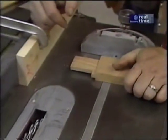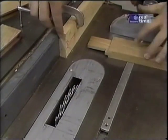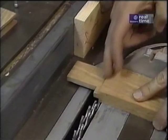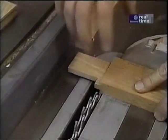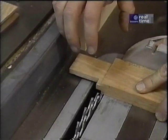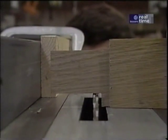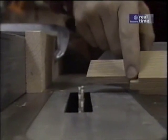I've set up the table saw again with the adjustable dado head cutter, and I've put this guide block here. That's just a reference to make sure I get this shoulder cut in the right place, and it also gives me some clearance when I come by here so that I don't get any bind up or kick back. Final adjustment to the height of the blade, and now I'm ready to make that cut for this little haunch.